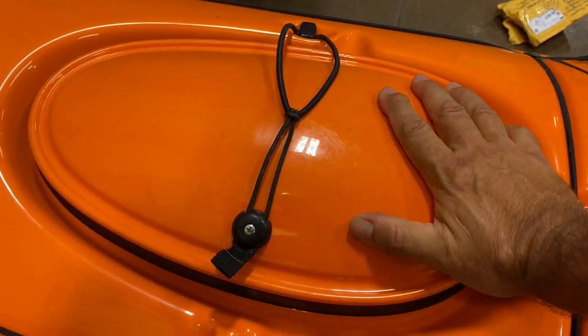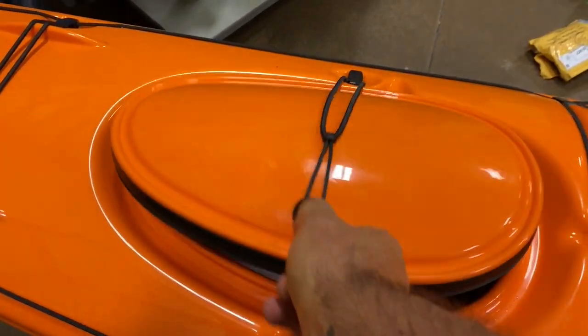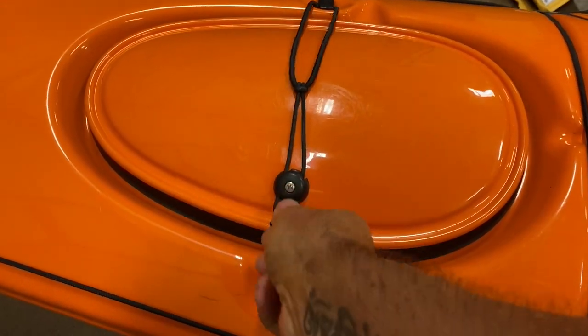What I do is take my microfiber cloth that I've got super saturated with armor oil and chuck it in a freezer bag and just keep it on board inside one of the hatches, just in case I need a little touch-up here and there. With regular maintenance of applying armor oil periodically, your hatches will pop on and off like a dream. I've even seen situations where people have pulled so hard with sticky hatches they've pulled the actual rubber gasket away from the hatch cover. So yeah, just a little bit of armor oil and you're factory new again.